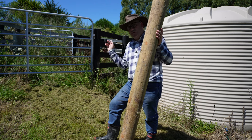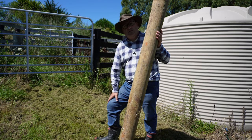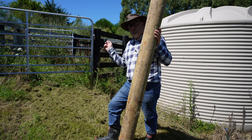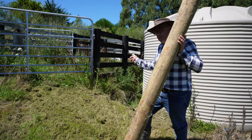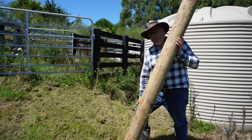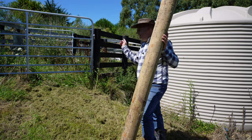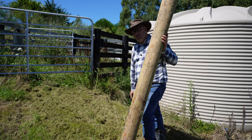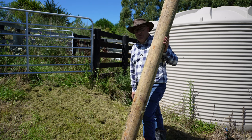Good strong vertical at this point, and of course we already have an incredibly strong one at that end. We'll be doing the same sort of assembly at the other end, so no doubt about it, this will be a very good fence. One thing I have chosen to do is to put an extra long horizontal across here. The greater the length, the less downward force we're going to have on this. There are all sorts of formulas relating to Pythagoras' theorem that basically calculate all of this, but the general rule of thumb is: the longer the horizontal, the stronger the assembly at this end.